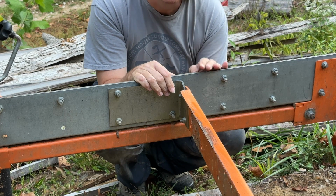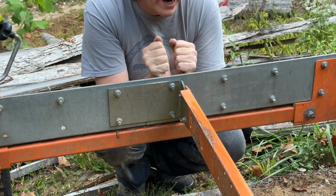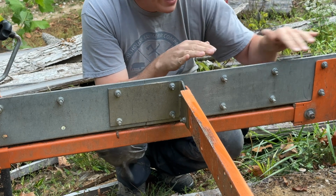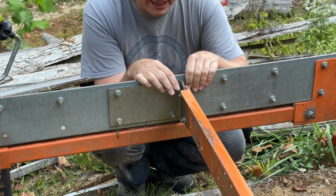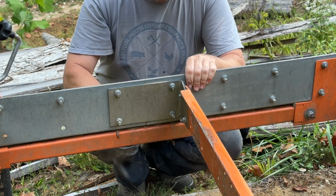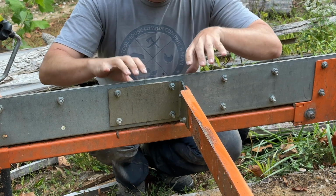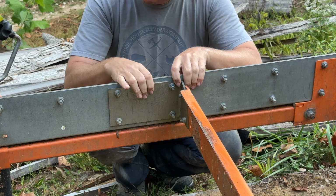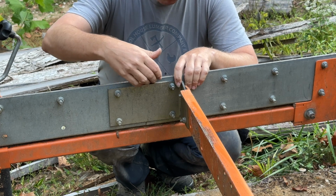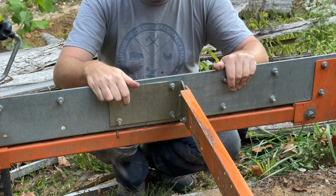My fear is that just because of that bend, and that's drawn in a little bit, that there's tension here pulling this track in some. I've noticed just a little bit of resistance. I don't know if that's why when I'm passing through this area, but that could definitely be causing it. So we're going to take the brackets off, and that could dramatically affect the alignment of the track. But fortunately, these outer rails are holding that in place too. So I think since those have been dogged down quite nicely, removing this bracket that covers these two bed plates will not allow there to be too much movement. Again, that's why we're not going to touch it and monkey around on a lot of things.